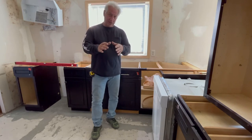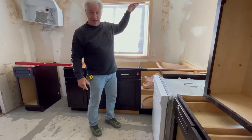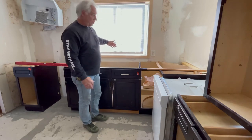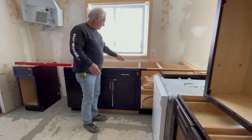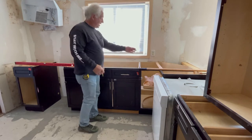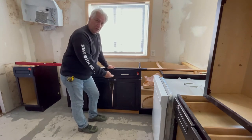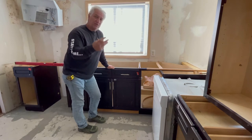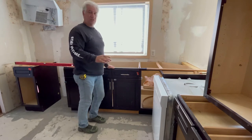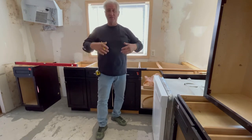What you're trying to do when you build a kitchen is — the biggest focus is that you basically have a box, but it's 3D: height, width, depth. You're trying to put a perfectly square box inside a box that may not be square. When doing a kitchen, you want the lowest point off the ceiling to start from. Find the most shallow location front to back, and the highest point off the floor. Those are your three points of concern before you start your kitchen install. Once you get those, you'll have a clean install. That's why kitchens are the hardest — they're 3D.